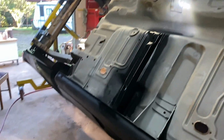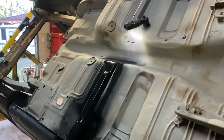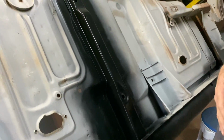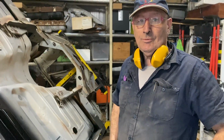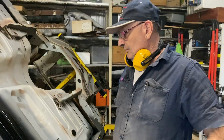Grey on one side and, well, they're both edge primer. It's just that I got black the second time. Yeah, it was maybe all they had in the shop. Actually, the reason I wanted it black is because when I do paint primer on, I wanted it to look different. Otherwise, you never know where you've done and where you haven't done. So this way, I know that it's just edge primer.